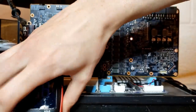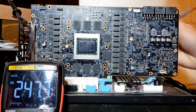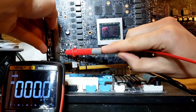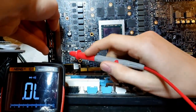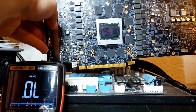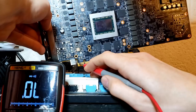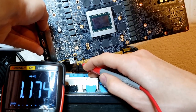Like all the cards that we get, we want to first check all the voltage rails. Let's start with the base voltage. We already know that one is short, but we want to make sure it's the only short rail. I have my multimeter in beep mode. If I probe ground, my multimeter beeps. Let's check 12 volts - the first three pins on the side of the connector are 12 volts. Checking any one of those first three pins, we're perfectly good.